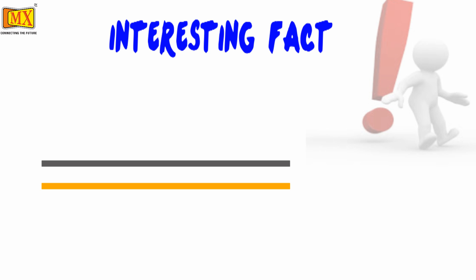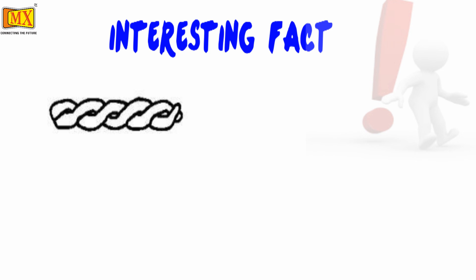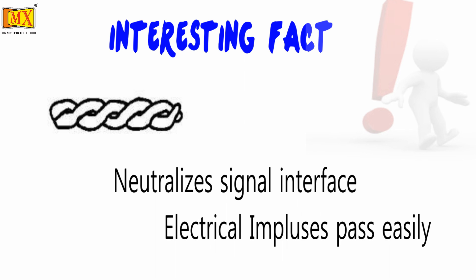UTP cable is actually a pretty interesting concept. Two electrical wires carrying voltage usually impact each other negatively, leaking electromagnetic radiation and bleeding signals to each other. This is why video cables use the UTP principle — UTP cables use two wires twisted around each other. Because the wires are twisted, they will not generate negative signal interference or any interrupting noise. Twisting them neutralizes noise bleed and enables electrical impulses to pass through both wires without any difficulty.